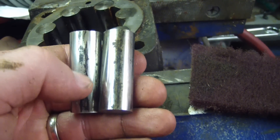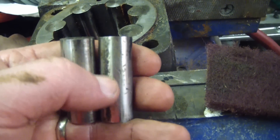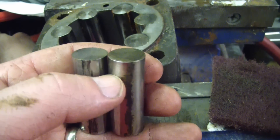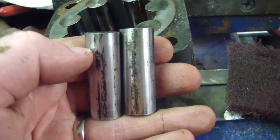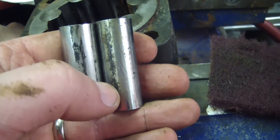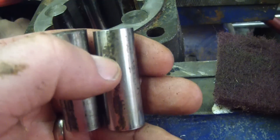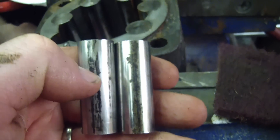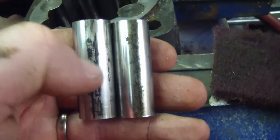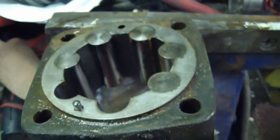I've got some of these hardened rollers out. Unfortunately, it's real bad - so there's no point. So unfortunately, this is completely hooped. I wasn't going to fix it initially and I ain't going to fix it now for sure. If you've got a high torque rotor motor and you see this, it's toast, buddy. Sorry. You might be able to polish it up and get an hour, maybe a couple days, maybe a month, but it's on the way out for sure. Can't win them all.